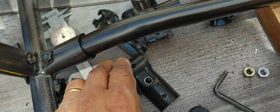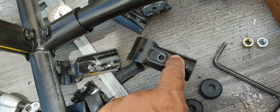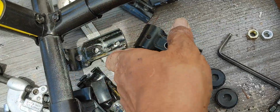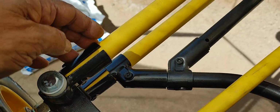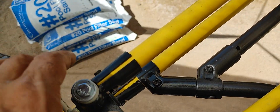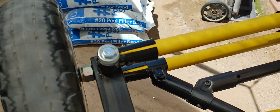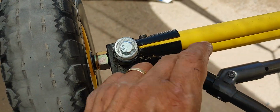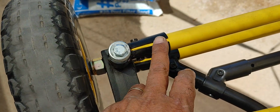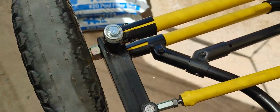I have done that before, drilling extra holes like I did on these, and I really dislike doing this because it ruins the connector. So it's better just to press the ends of the pipe with a die like I did. I showed that in another video, how I did that, just with a PLA printed die put on a press, and then I create these indentations so that it fits and matches the inside geometry of this connector, so that it clamps it a lot better, more secure.